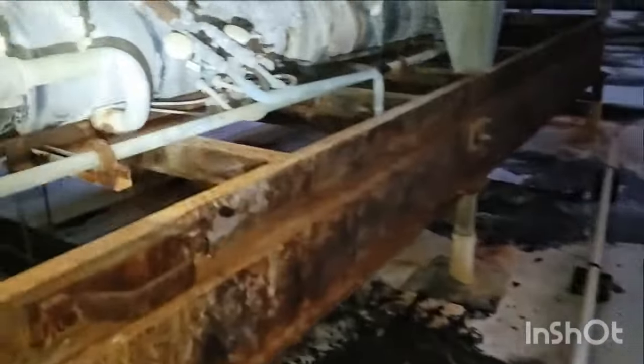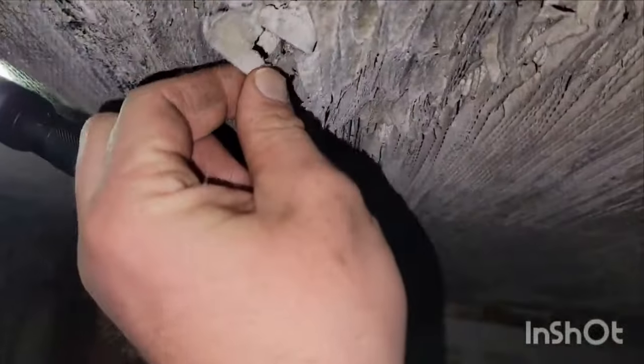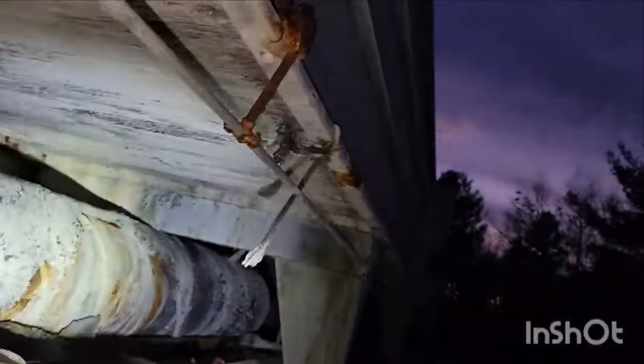Obviously, we're going to check the high discharge pressure. The first thing you would do is check the condensers, okay? So you come on here and take a look. You can see this condenser's junk, absolute junk. This is how you know you have a bad condenser. It's terrible, it's awful, but currently it's not the issue. We know what the issue is already. But you would take a look and see, is it plugged and is it junk? Well, it's junk. Okay, but don't just stop there.